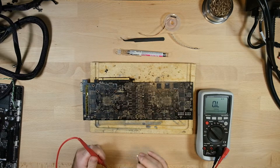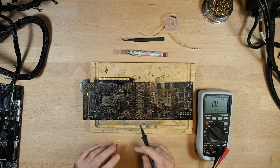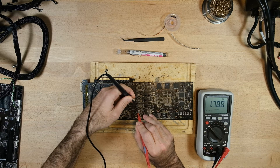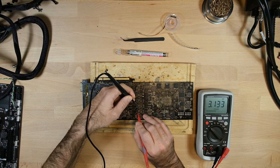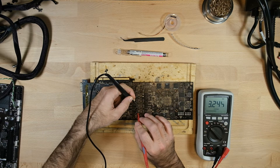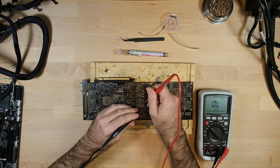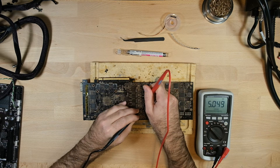While the iron heats up, let's take a quick look and remind ourselves of what our situation is. If we look at our number one 12-volt rail — the one that powers our number one GPU — our resistance to ground on that one maxes out around 3,000 ohms. See this? It climbs up to 3k and then keeps climbing slowly. What's happening is it's charging this bank of capacitors, and as it charges them, the resistance increases. But once it gets them charged as high as it can, it stops, and then you see the resistance behave like that.